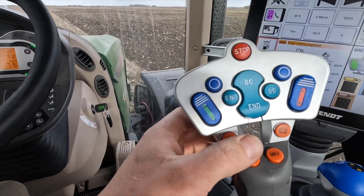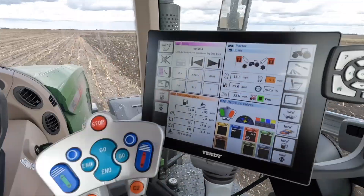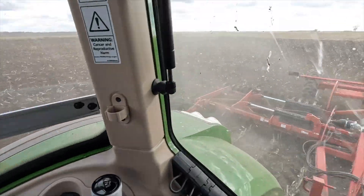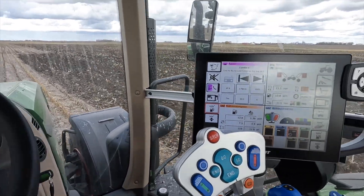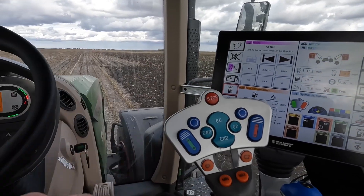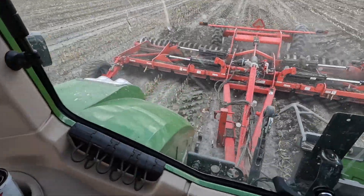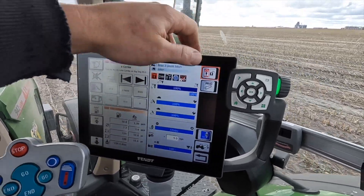You can set up C1 and C2 here for cruise control - two different cruise control speeds. I've got C2 set at nine and C1 set at 15. I'm in C2 now - I slowed down a little bit so it wouldn't be so bumpy. A lot of times I'll set one up for road speed and two for field speed. So if you're going over the road you push C1 and it'll go to full road speed. When I push go, the tractor steers itself back in line and the disc drops down into the ground.